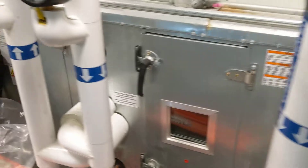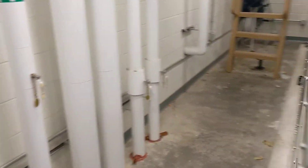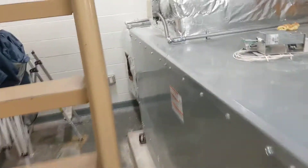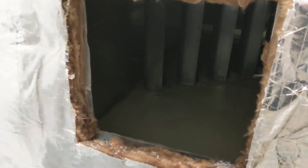If we go around, this is another air conditioning unit that we'll be doing next. I also wanted to give you a look at what the ductwork looks like before the access door gets installed. Here we can see the hole has been cut — we cut the insulation back and then cut a hole in the ductwork with either nibblers or electric shears. And again, more turning vanes because it makes a 90 degree turn.